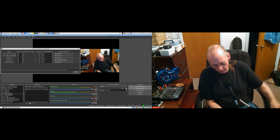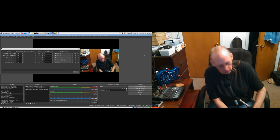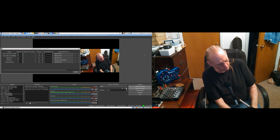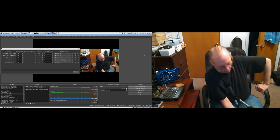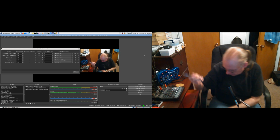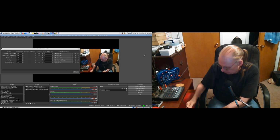I think maybe they don't write manuals like they used to. I think maybe they're trying to use commonly known technology words, and they're not the same thing. Balanced TRS is not the same signal, not the same wiring, which was even in the manual. Something I saw that I'd forgotten or surprised me. Didn't seem right to me when I saw it. I won't even go back towards that, but on TRS, we just always said TRS when we meant either balanced or TRS, and that meant a balanced cable, because in pro sound, that's what you were talking about.